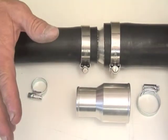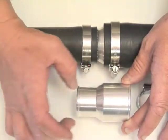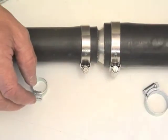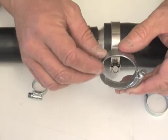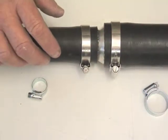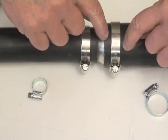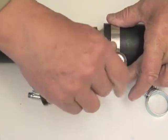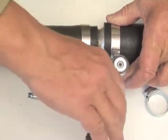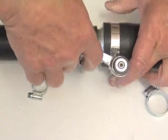It's important that any joiners you use in your plumbing system have beads on them. Once your jubilee clip is tightened, it prevents the hose from pulling off under pressure — so it's a security thing. Use good-quality hose clips; these clips from our range have a radius inside edge so they don't cut into the hose. Always position your hose clips midway between the end of the hose and the bead, and tighten them with a spanner, screwdriver, or socket — nice and tight. Always go round and re-tighten them after you've run the engine for a few minutes and got it up to temperature.